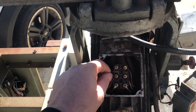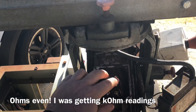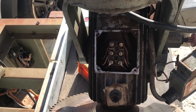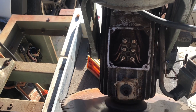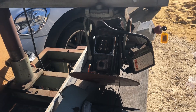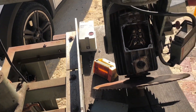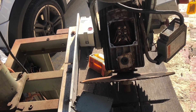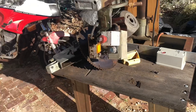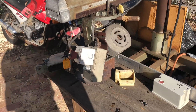I'm expecting there to be values in the region of kilo ohms, or balanced anyway across coils, but I'm not getting that. So the suggestion at this point is to rewind the motor. This particular three-phase motor is probably going to cost about $400 or $500 to rewind and I don't have that much in the saw, so realistically it's not economical for me to repair it. Which leads me to saying this is a fun experiment — maybe I can rewind it myself and learn something and make a video of the process.